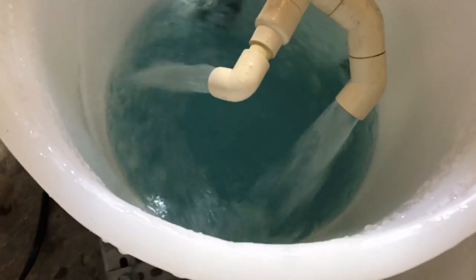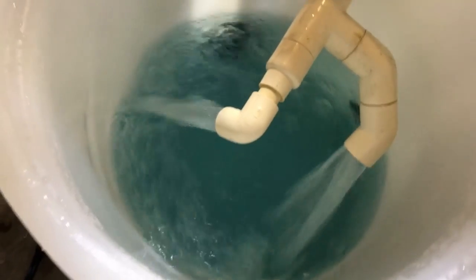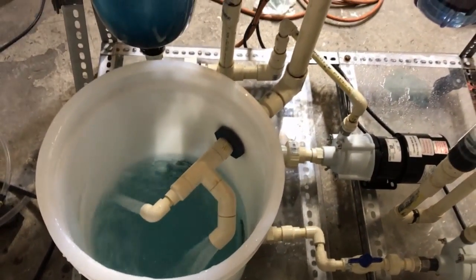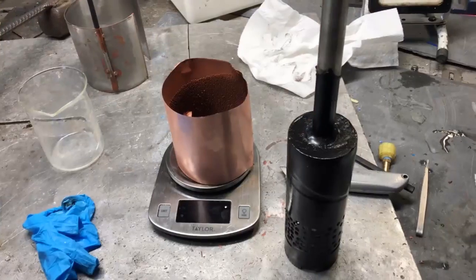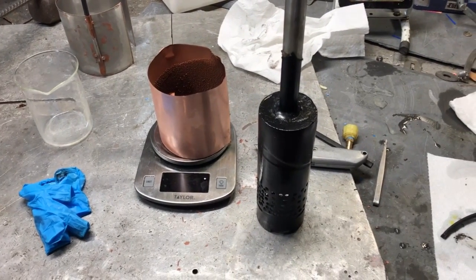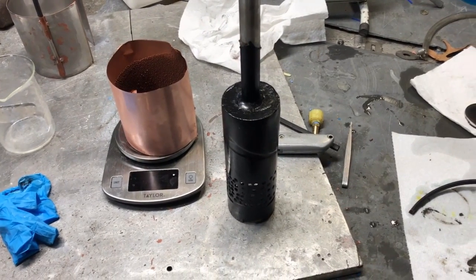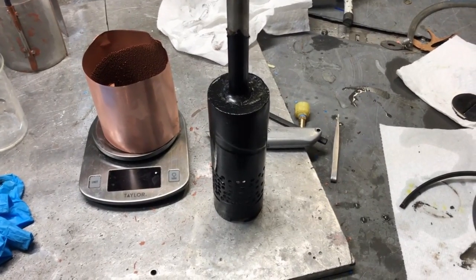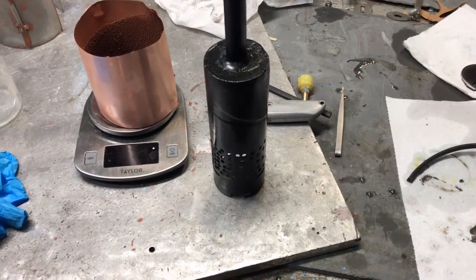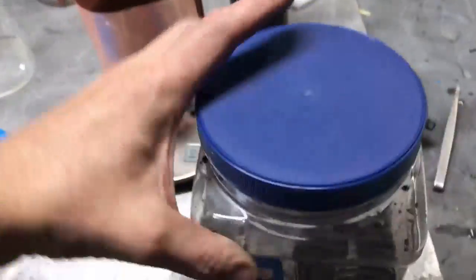Here's a look at the flow rate so you can see it with the eye. A lot of bubbles are entrained in there, so it could probably do better, but I thought I'd show that before it gets buried in water, because I don't like the entrained bubbles to mess with the cyclone action. I have read in intellectual literature regarding this process of electrolysis with experimental cells that lead accumulation on anodes is something that happens. So there's a possibility that the accumulation of lead on this anode has taken place, and that is why it weighed heavier than it tared out in the beginning.